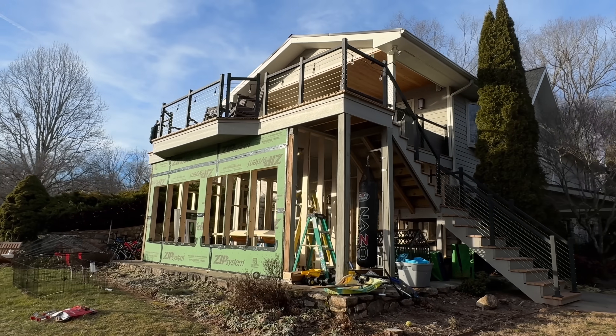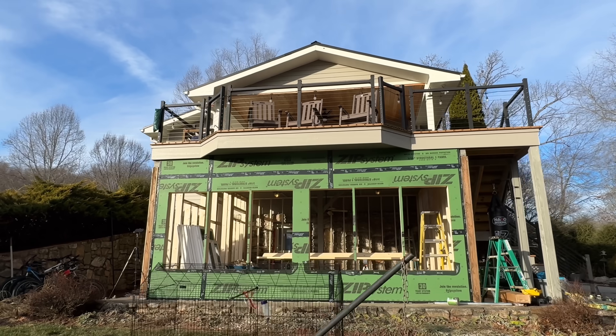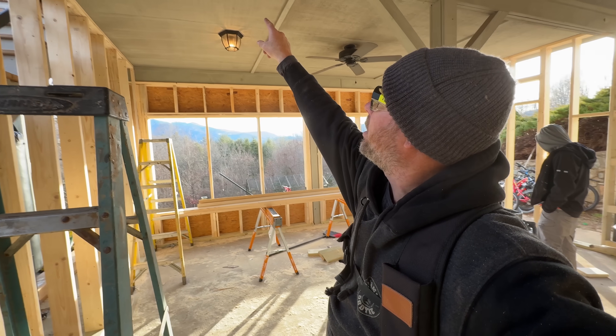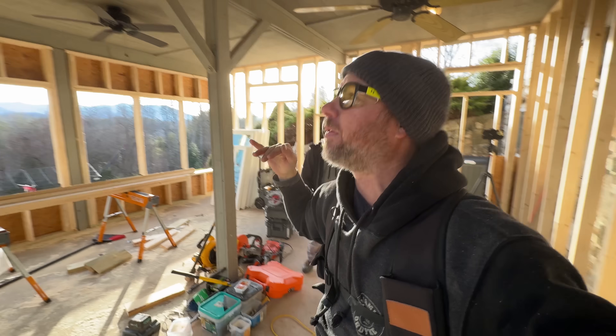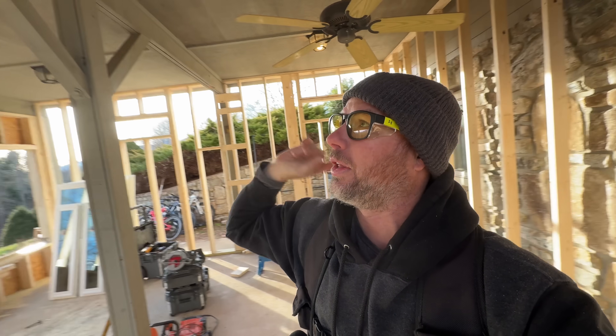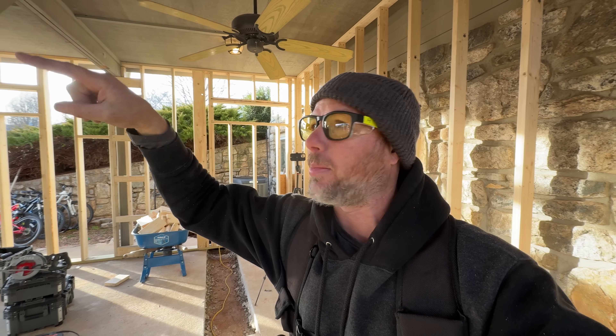That was a good day. Even though it was cold, we've got all of our exterior walls in here wrapped up. Tomorrow we're going to tackle the ceiling, which is going to be two-by-six joists that I think are going to be flush with the bottom of this beam, because we need that depth for enough insulation to pass code. Also, this is really sloped — it's probably three inches lower on this end than on this end, and I want this to all be flat. I'm going to get out here when it's dark in the morning, set up the big rotary laser so that I can see the beam and make marks all the way around on the framing to nail our bands on for these ceiling joists.